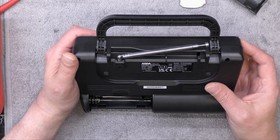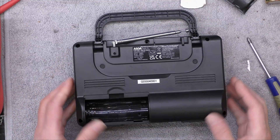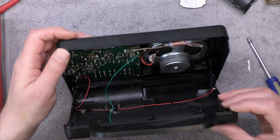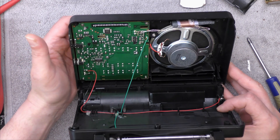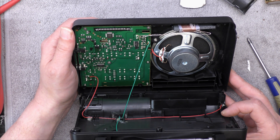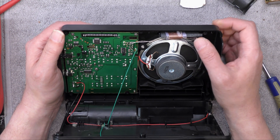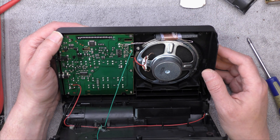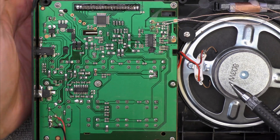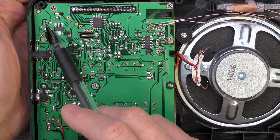That's quite high current consumption. An all-analogue radio would probably draw around 20-odd milliamps — hence the D batteries, I guess. It's got some felt pads and six screws to get into it. I think it's time to take it apart and see what makes it tick. I can see three ICs and a crystal — that's the phase-locked loop. Eight ohms at three watts. The ferrite rod is quite a disappointing size but it's quite sensitive on AM. There's a bridge rectifier and a voltage regulator, with a smoothing capacitor under there.